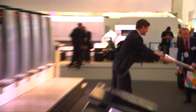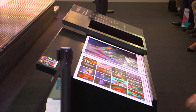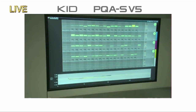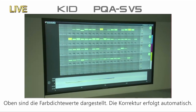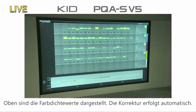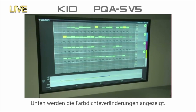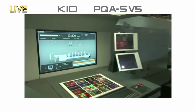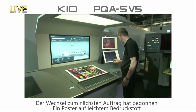Even with high-speed printing it's completely dry instantly. Next, I want to introduce you to the KID Komori Info Service display screen. Our cameraman Gavin is showing you a live feed on the screens — PQA version 5. You can see the densities for the ink keys in each unit displayed along the top, automatic compensations being performed, and the trend graphs of average density along the bottom. Combining the high performance of the Lithrone G29 with these systems gives you extraordinary productivity.